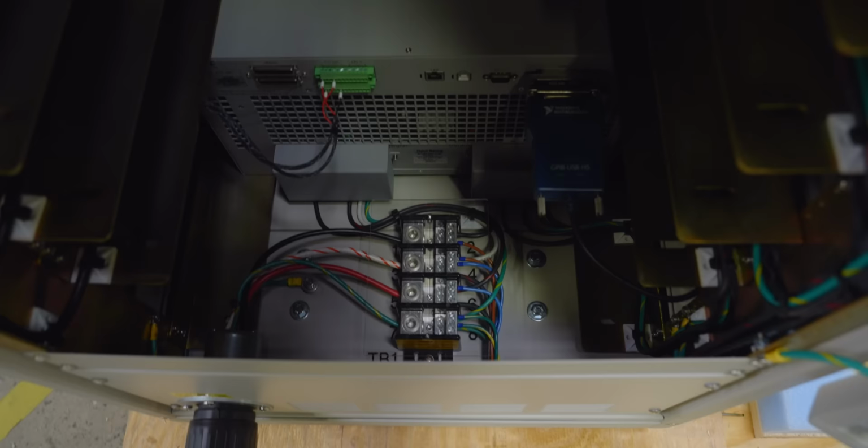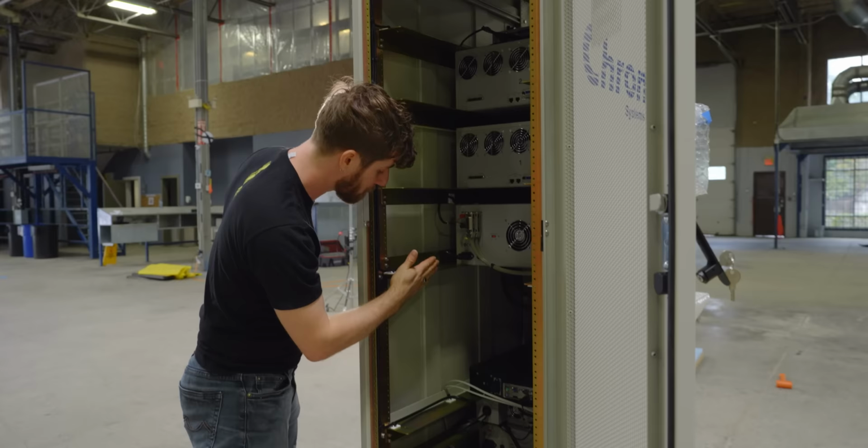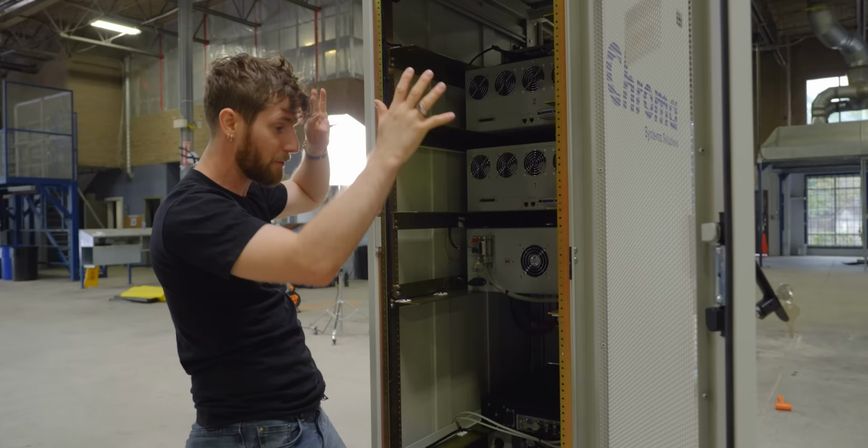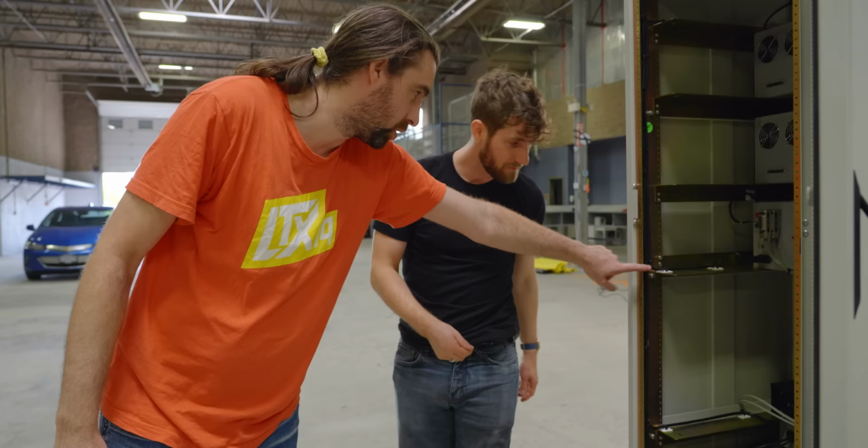You can see from the plug, we've got a ground connection to this gigantic bare metal strip here, and then unlike a normal server shelf, these are bare metal as well, and they're screwed in like this. What that means is that every single shelf, every piece of metal in this entire enclosure is grounded. So in a production environment, that's important because if a live lead were to short to the chassis, and an operator was touching it, you want to make sure the operator isn't the lowest path to ground.